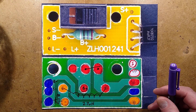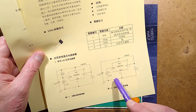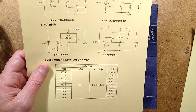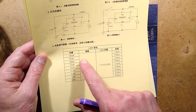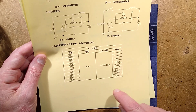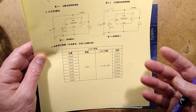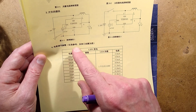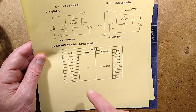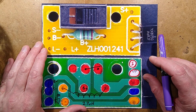It's a very standard circuit — in fact it's the second circuit shown in the datasheet for the YX8050. You can add a cadmium sulfide photocell if you wanted it to turn on a little later. The datasheet gives inductor sizes and current flow: a lower value inductor gives higher current — from 10 microhenries at 40 milliamps up to 100 microhenries at 3.3 milliamps. Many budget lights use 150 or even 330 microhenries so they act as a dim marker light but last much longer. In this unit it's 27 microhenries, giving approximately 15 milliamps output.